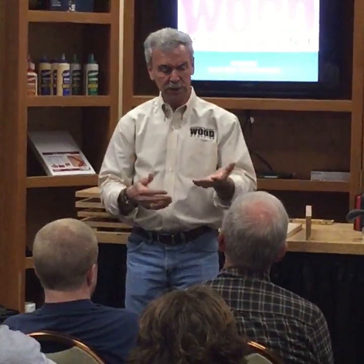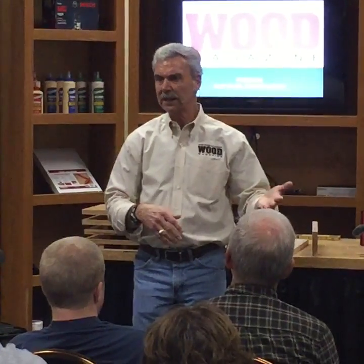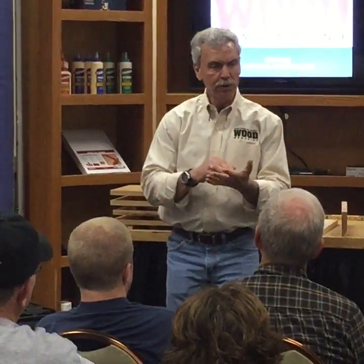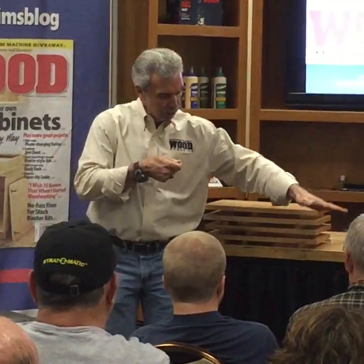But a lot of times when you look at wood, you're not being quite as critical. And if you've got a board with a very slight little bow or a little cup or a twist, you're never going to get that board to operate and stay flat, because it's going to stay the way you bought it. So my feeling is, you should be the customer that if you owned that store, you wouldn't want you as a customer, because you need to look at every board. If you've got a board that's maybe 6 feet long, and you can push on the center of it a little bit, meaning you can take that real slight little bow out of there, you're thinking, yeah, that's good. I'm going to cut it into 2-foot pieces anyway, it'll be fine.